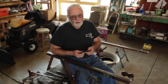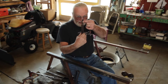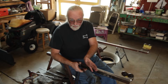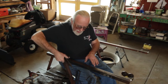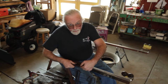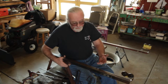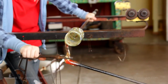It's also good to have another pair of shears for trimming open mouths — these are referred to as duck bills, obviously because of the shape of the shear. When you're using duck bill shears or any other shears — say you're cutting off the open end of a piece to open it up or straighten it out — one thing you always want to remember: as you roll the piece away, you want to be cutting in a downward motion, down and across on the bottom of the piece, so that what you're cutting is falling away. If you cut across the top, that piece is going to fall back onto what you're trimming, and you'll have a mess. So remember: cut down and across.